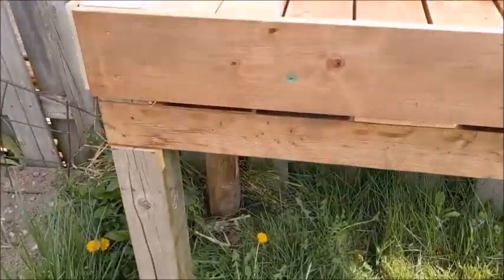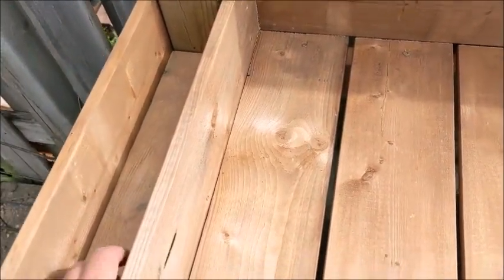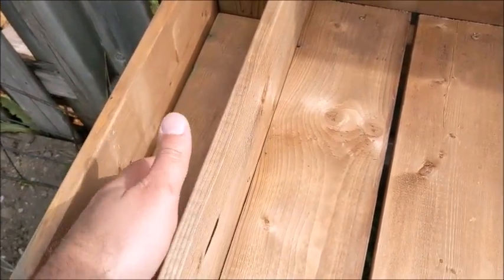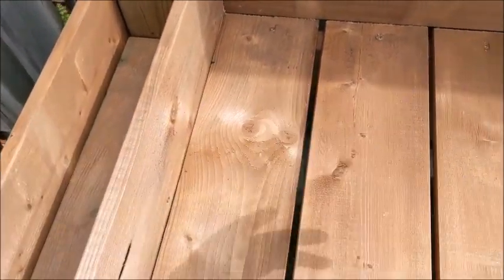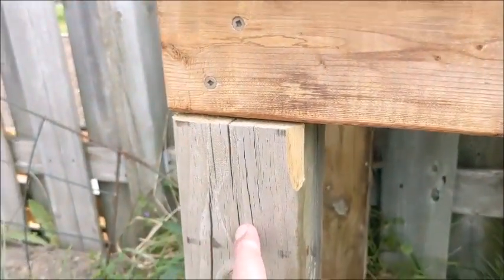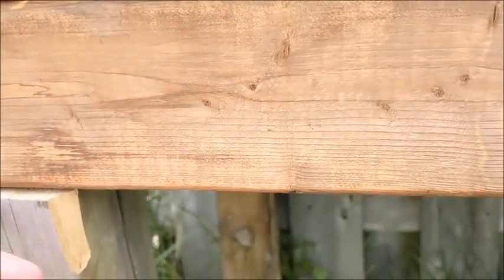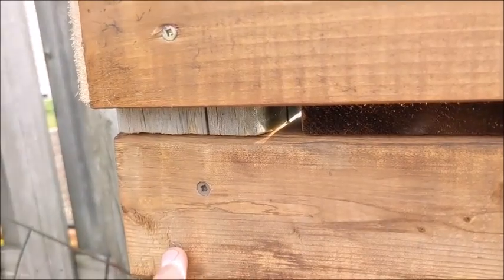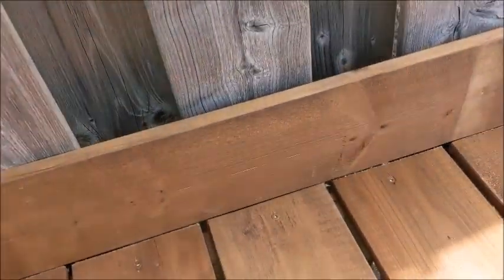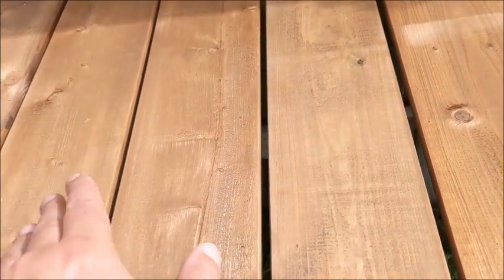So I built one of them — just going to show you what I did. It was going to go straight across, but I figured it'd be nice to put a little thing there so you can put your tools and maybe your pots before you transplant your stuff. So I put little holes on the side here. And for stability, I notched out for the two by four to sit so all the weight of the dirt will sit on this that sits on that, instead of just sitting all the weight on the screws. Running the boards width-wise instead of length-wise, I don't need to put any more of the brace than a two by four on each side. I left little gaps here for drainage and then I'll put a weed screen over top.